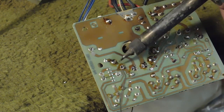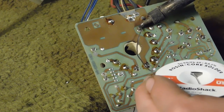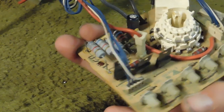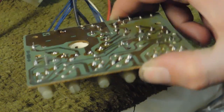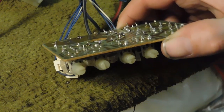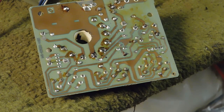As mentioned in the how-to-solder video, you want a nice little cone of solder — not a blob, a nice little cone. Now that I've got those in, I can go ahead and get the spots I tacked earlier filled all the way in with solder. Looking good — it's not flowing through the other side, everything's in good shape, it's flush with the board, and the solder actually looks pretty good. Not A-plus, but it's definitely going to work. They're not blobs, they're little pyramids or cones of solder, holding strong.